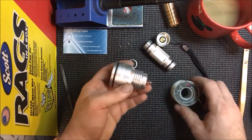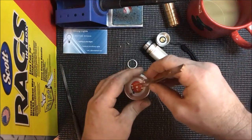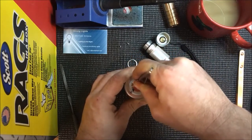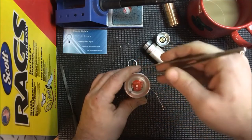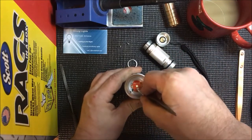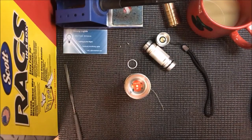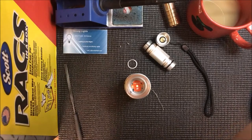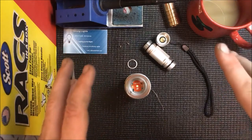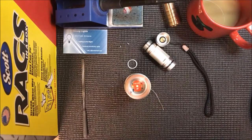You've got to be comfortable — that's the key to anything, whether you're welding, soldering, you name it. Figure out your ergonomics. I'm just pressing down on that PCB and giving it a little wiggle to squish out some of that thermal compound. When you see it starting to flow out here you probably used just a fuzz too much — but a little bit's okay. If it's coming out all around, you used way too much. Take it off, clean it, do it again. For my custom lights I actually hand lap my heat sinks on a granite surface plate with 800 grit sandpaper — get all the machining marks off, nice flat surface, which really helps.